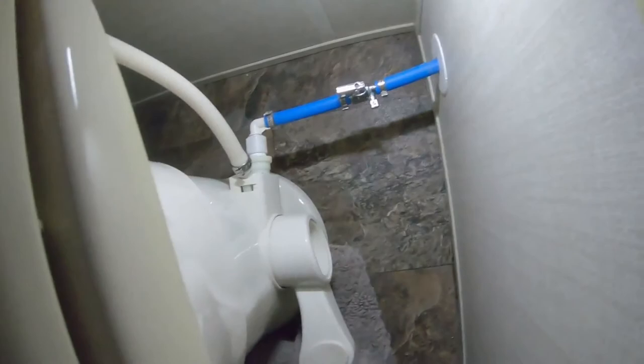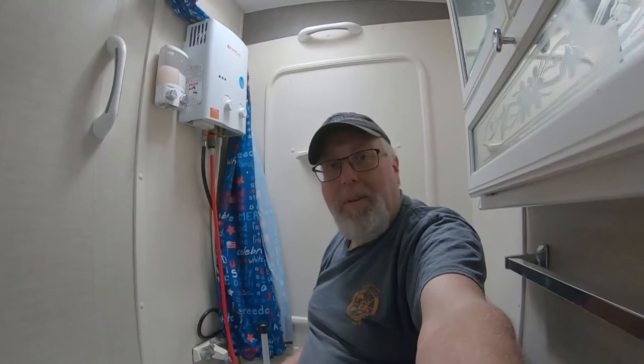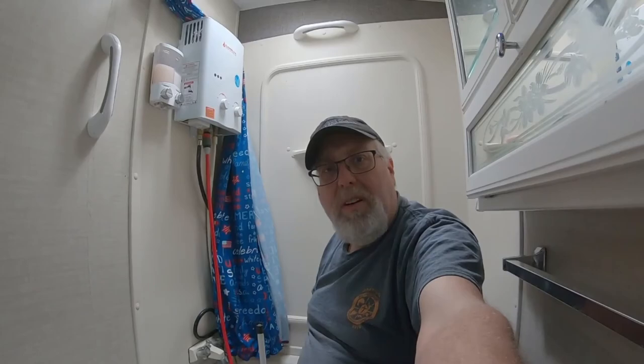So there you go, we got the valve changed and everything. There were a couple of stiffer, tougher points trying to get that line coming from the top down. That rubber was a little hard to get the old valve off and the new one on, and I had to put a little bit of effort into it. But if you wanted to, you could go ahead and replace that with a more flexible line and do the same thing with the crimps and everything.